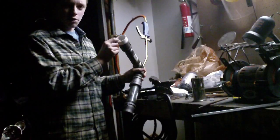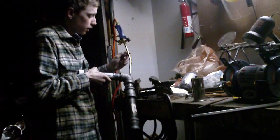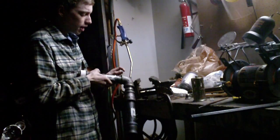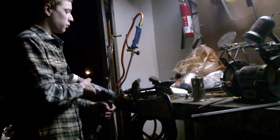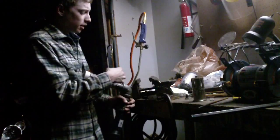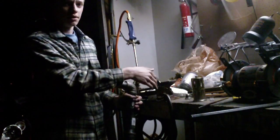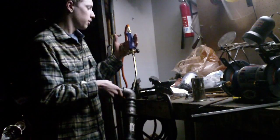It really depends on what kind of blower you're going to put in there, but for the most part that's the way you need to do it. I drilled and tapped this hole — it was like three eighths by 20, but it was really weird, I think it's metric. I had to drill it out a little bit, screwed it in there, and then just soldered it so it's got a really good seal, because it's never going to have to be taken out anyway.